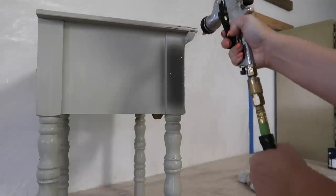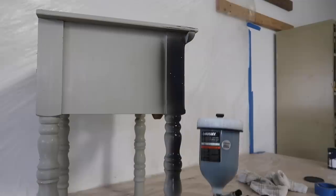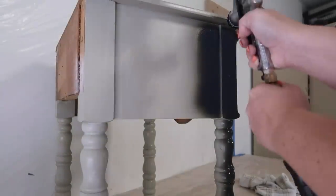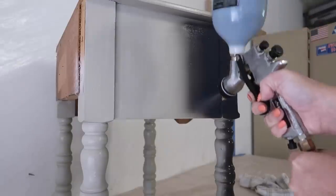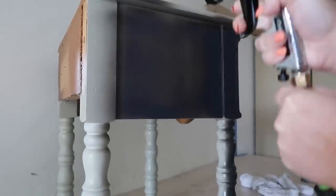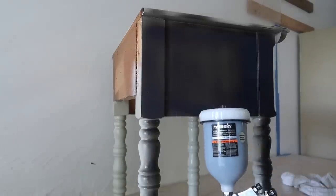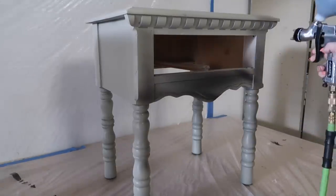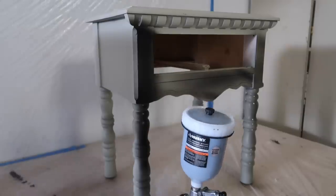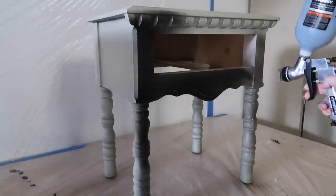I will have this paint color linked below. It's just a color black and it was a pre-made paint I picked up at Ace Hardware for just $9.99. This is a matte black and I thought it would look really cool with the whole design of this room. I'm also using a spray gun — they run from $15 to $60, some can be more expensive — but I just hooked this up to our compressor and it really gets the job done quick. These nightstands took about one and a half coats, maybe 15 minutes to do both of them total.